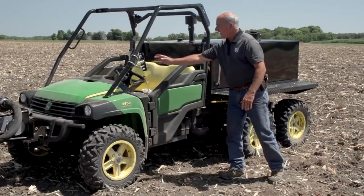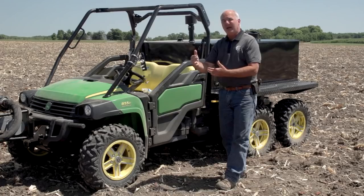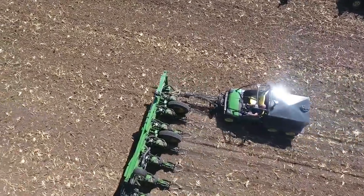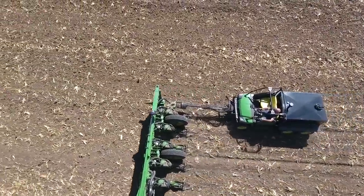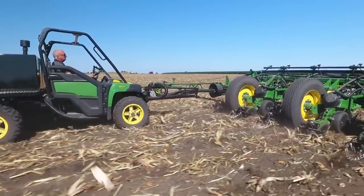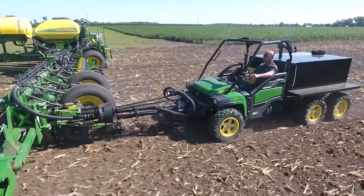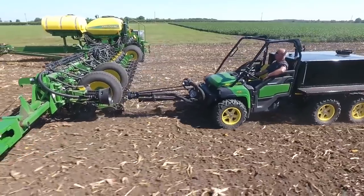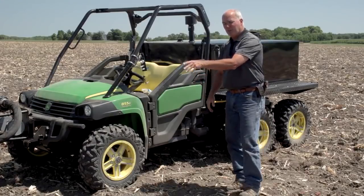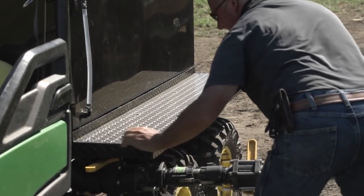So once you start your pump, you come in and hook with magnets. We have 1,100 pounds of magnets that will come in and hit a steel ring inside the funnel. We come in and connect, and then we back off. And you have 32 inches of travel back and forth while you're hooked and pumping. When you get ready to disconnect, you roll your Gator up a little bit tighter, you hit your magnet off, and you're going to disconnect. And at that stage, you're going to loop around, get right back in your track, and head back to the nurse tank to load the next 300-gallon.